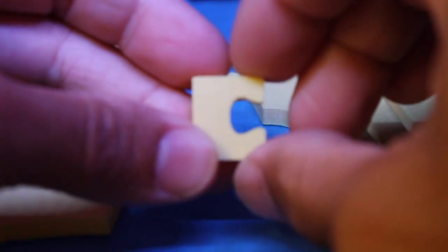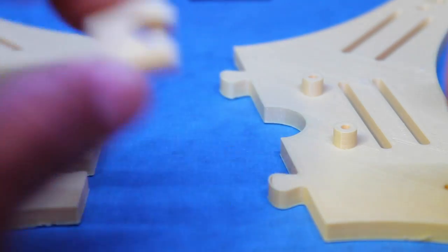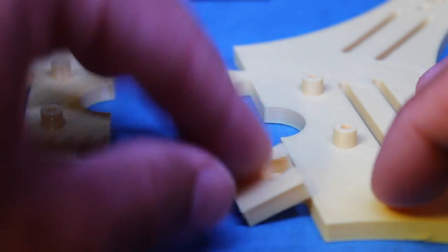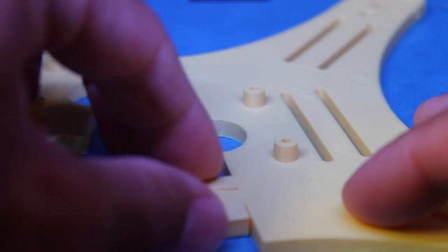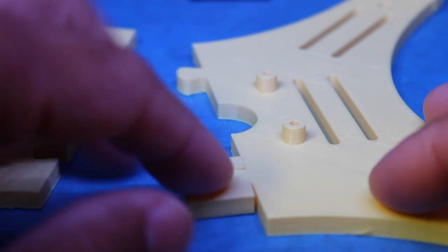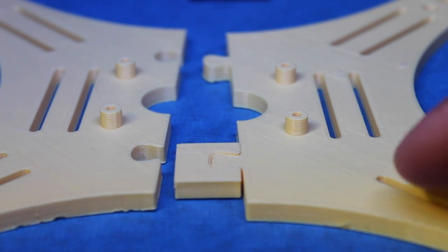What I do to overcome that is I just take a little section of the design out. You can see that's the little female end of the tab — I printed this before I printed the left half and just slid it on there to make sure that it fits. I used obviously a lot less PLA and the design fit nicely. I had to tweak it once or twice but got to a size that can accommodate snapping the two together.